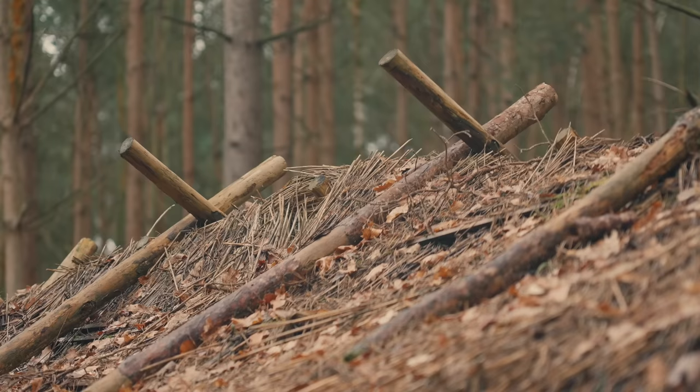One other thing I would definitely have added is some shutter boarding for this gable end, all the way up and down - for two reasons: to cover the gap between the thatch and the rafters which lets in a lot of airflow, and to cover this side of the thatching for a much more aesthetic look. Some flat boarding there is definitely something I would have changed as well.